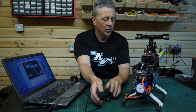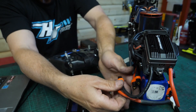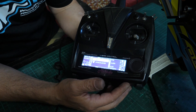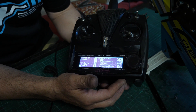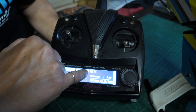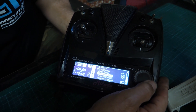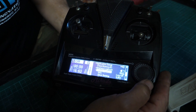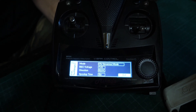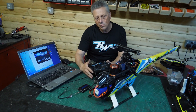Now we can check with the radio. With the transmitter switched on, let's check it all works. We reconnect the data cable from the Neo to the Hobbywing and plug in. Remember that you do have to update your transmitter to actually use the new firmware, otherwise you won't have the parameters in the transmitter. Make sure that we've got the Hobbywing symbol there, which shows that we've got the application set up. Down to the bottom there, we've got 'Hobbywing ESC', and we can scroll down to 'Settings'. We've got the settings in there where we can actually change values in the ESC — so that's all working beautifully.